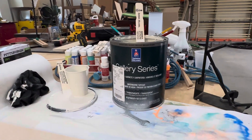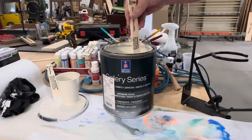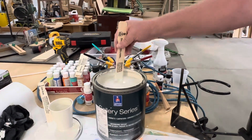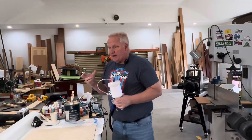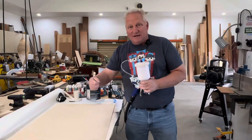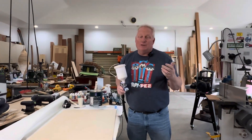This Gallery Series paint from Sherwin-Williams is something new — it works similar to a lacquer, it has less VOC so it doesn't have the odor, it's water-based, and you can add it in any color you want. They also make it in a clear. I did a piece of white trim molding at the demonstration yesterday and it came out awesome. I want to see what this HVLP does with it. I'm going to put two coats on here, going with the grain and across the grain.